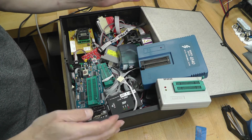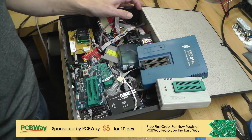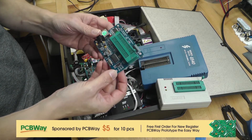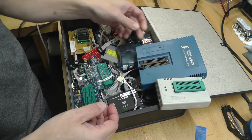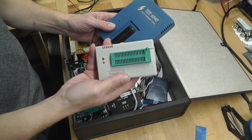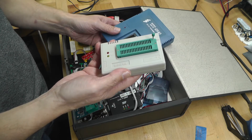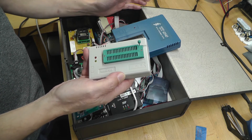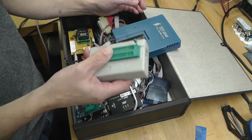Over the years I've acquired a few different programmers — some purchased, some homemade. I thought I must have something that can program the 27C-2001. The QLS is a nice little programmer mainly aimed at PICs, but it doesn't support the 27C-2001. I prefer the Mini Pro — a great little programmer I've used to program EEPROMs and it works great — however with the 27C-2001 I came across a problem. It started to read the original ROM as a test and would abort halfway through with an error. So whether there's a bug in the software or not, I don't know, but I put that one aside.